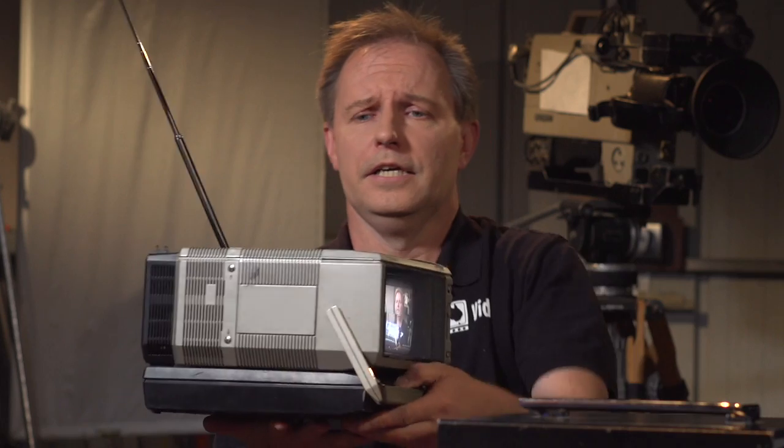What we did for live crosses is we used to put an earpiece in for the journalist, and the journalist could actually take their cue off air because back then there was no delay — it was live, not a digital signal. So what you see is what you get immediately, perfect for tuning into the channel. Channel 9 — the reporter would have it in their earpiece and they'd take their cue off air. Also, in my day, that was the monitor that was in the helicopter. They made up a special bracket on the right-hand side at eye line for the pilot, but it didn't work very well because of the vibration — and once a bit of light hit it, it wasn't really daylight readable.